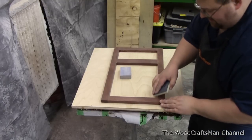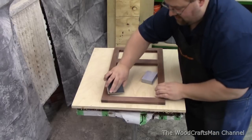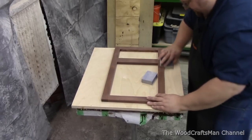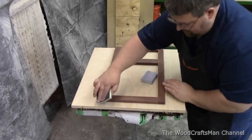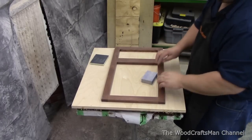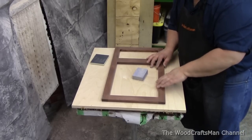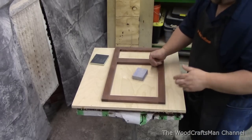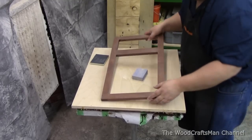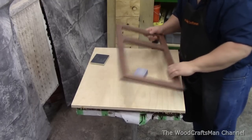And usually what I would do is just take a piece of the sponge here and just lightly hit the corner, just to make sure that it's being sanded. Doesn't take much. And you don't want to be too aggressive with it either, otherwise, like I said, you will burn through it. But the key to making that work is making sure that you do the same thing in the whitewood sanding process. I take a piece of sandpaper, whatever my finishing grit is, and I go over and rub across it a couple times just to take the sharp corner off. All right, I'm gonna do the door and drawer front the same way, and then we'll get set up to spray the final top coat.